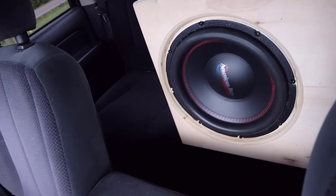Another factor outside of Hoffman's Iron Law is the environment the subwoofer is in. If you put a subwoofer in a car, for example, you're going to get a significant boost from cabin gain. That's really fortunate because it gives you the ability to put the subwoofer in a slightly smaller box.